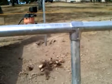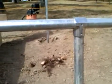Then I took the pipes over to the racking system and slid them into the T-fittings. You slide the pipe in, set it against the top of the T-fitting, then tighten the bottom of the T-fitting using a 3/16 Allen wrench. You leave the top one loose so you can slide it back and forth to center it in the hole, and also adjust it toward or away from you if the vertical isn't exactly centered.